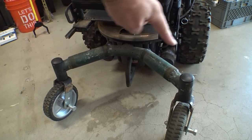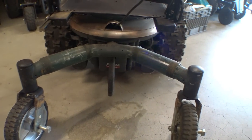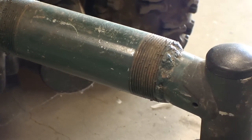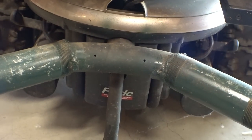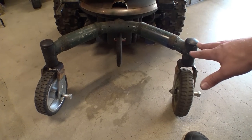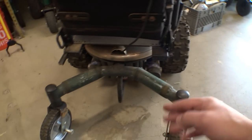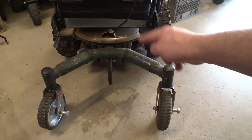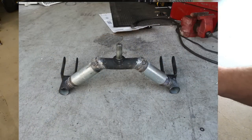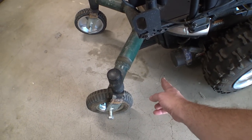Originally on the back of this chair, this bar went right across and the caster wheels were basically right here and right here. I got some big threaded pipe connectors — you can see how these have threads on both ends — and they were about the right size. I pulled the bar off the back, lopped the ends off, figured out where I wanted the caster wheels, wanted them pretty close to the outside edge but about in the middle of where the tires were. I eyeballed everything, put a couple of tack welds on, bent and hammered it around until it looked right and even, then blasted weld around both sides and put the end caps back on. That basically got our rear caster wheels back out from the chair a lot further — because before, they were right here.